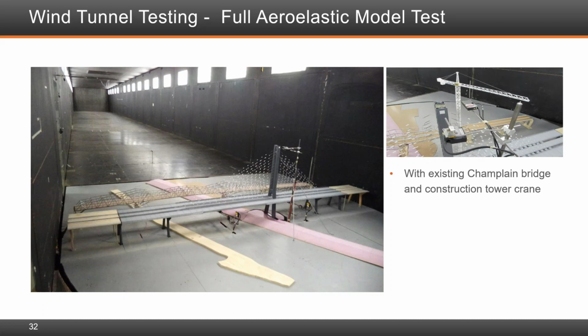Okay. Marwan, I think I can just add to that. We specified what were the industry best practices in terms of wind analysis and wind requirements for the cable stay bridge portion. And I think we mentioned that it's a 1 in 10,000 year wind for aeroelastic stability. So I think we had good coverage on the wind requirements for that project.